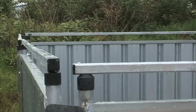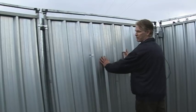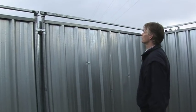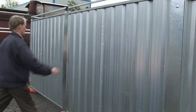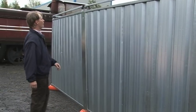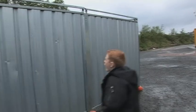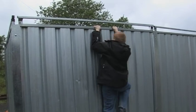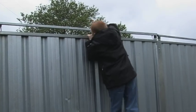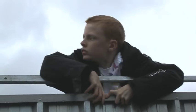Now we will demonstrate the climb-over aspect. The system has been designed to ignore just about any movement that can occur to the fence except specific events. So we can shake the fence and we can kick the fence and nothing happens. Even in high winds the top bar does not deflect. Now our volunteer will demonstrate what happens when the fence is climbed. As you can see, there is no way over the fence panels without creating the 3 pounds of force required to deflect the bar sufficiently to cause it to alarm.